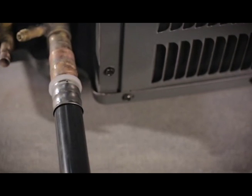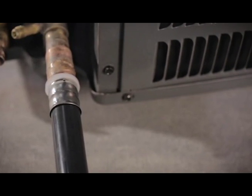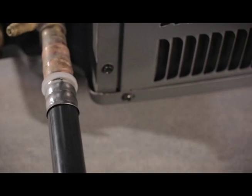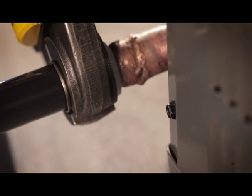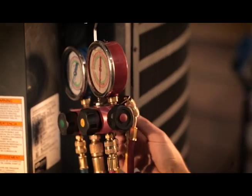Note: it is imperative for the tool to be positioned properly. An improperly placed tool could lead to an incomplete seal of the fitting. Keeping the tool perpendicular to the fitting and properly positioned, complete the crimp using manual or power crimping tools. Ensure that the jaws of the crimping tool come completely together.